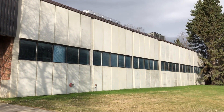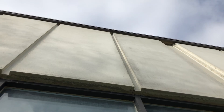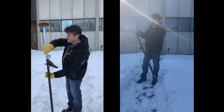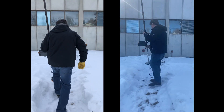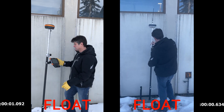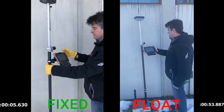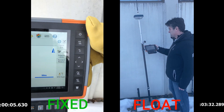The second test is a two-story building that takes out the entire south sky — and that's important because in Canada, that's where all our satellites are. This was always an impressive test when we first did it with the S631. We flip the antenna, lose the fix, walk it over to the stand, and once that point hits the ground we start the timer. The S631 handled this without any issue, fixing in 5.6 seconds — no issue even when losing over half of our sky, including the most important south sky.